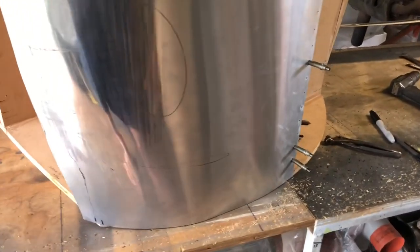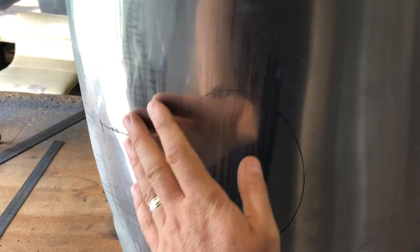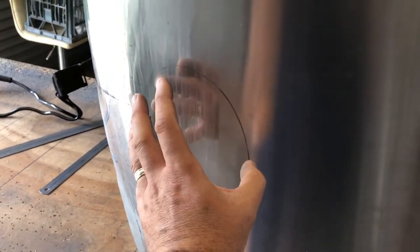A little bit of interesting stuff to note. I'm using this back edge as my baseline or profile and that helps me work out what needs to happen in this area. I've just been stretching from here and you can see I've marked this area because there's a little bit of a dish starting here, so we needed to start raising that area as well.